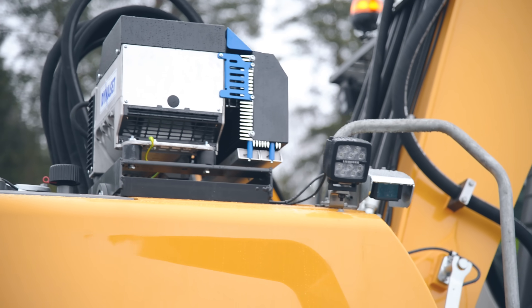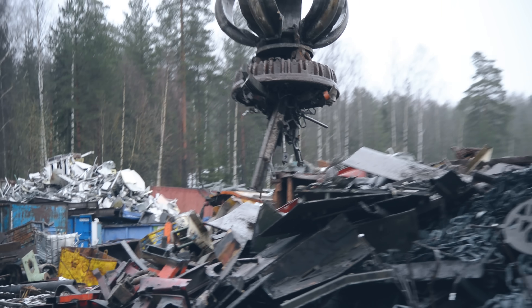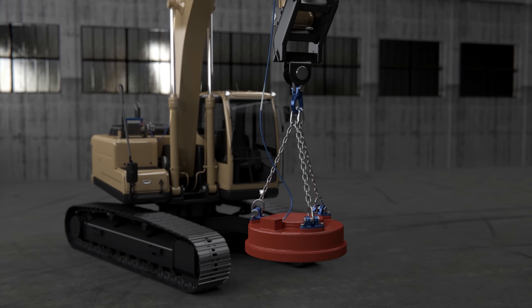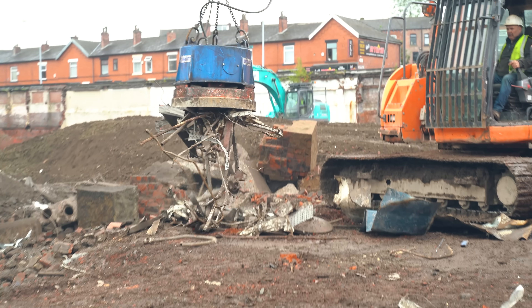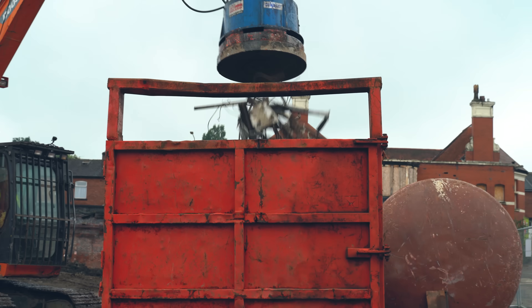What about the magnet power? The key idea in the magnet power is to be able to actually handle magnetic scrap metals and things like that that you might want to be clearing from the ground. There are two ways of doing it. One is to have a magnet generator on top of the machine that actually generates the DC electricity for the magnet — this would be good in a situation where you have one machine using the magnet and other tools. The second one is to have the H-mag unit, which is basically a unit that has the generator in a casing on top of the magnet, and this allows the magnet to be used on separate machines since it takes the hydraulic flow from the hammer line of the excavator.